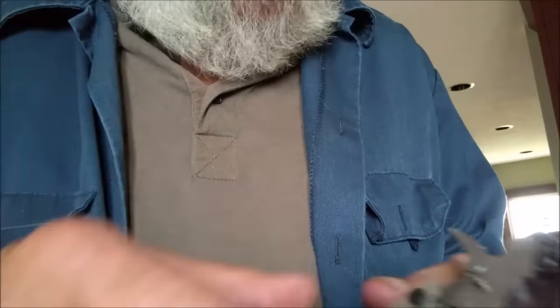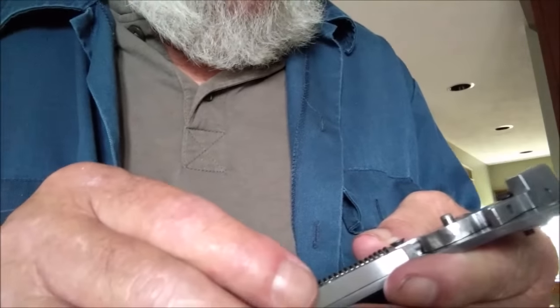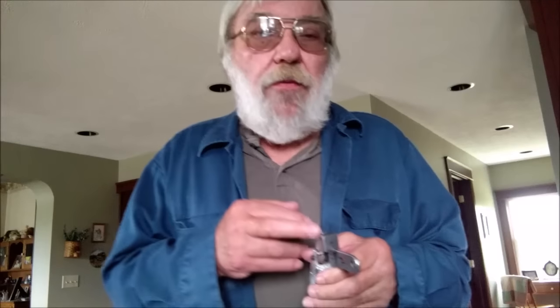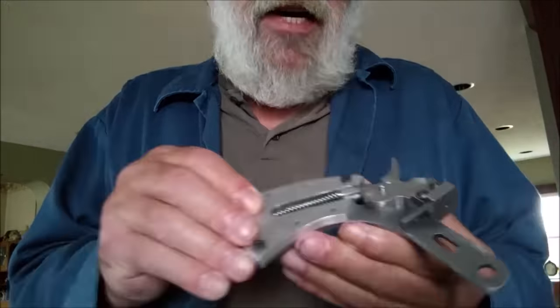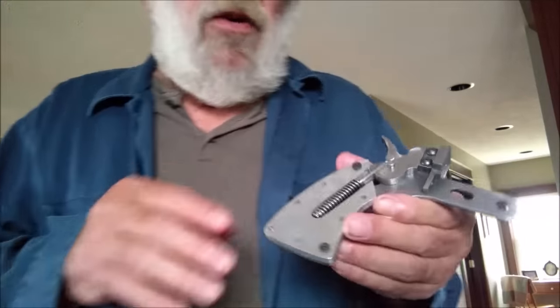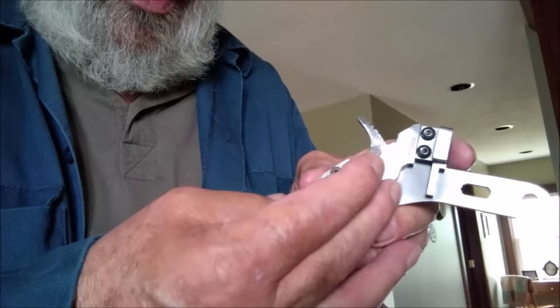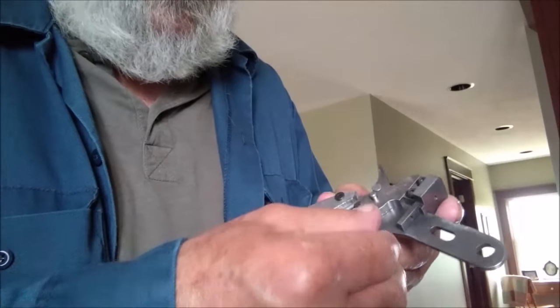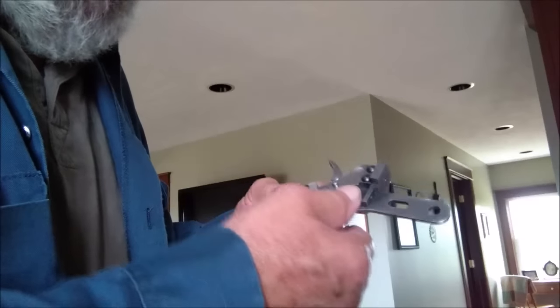I kind of threw it together last night. One thing I have discovered — like on my break-barrel shotgun, I silver-soldered the receiver together with the breech plug and you can't take it apart. When you bolt the breech plug in and can work on it with one half open at a time, it makes things so much easier because you can see what you've done. I'm sure when I get to making the trigger, sear, and sear notches, it'll be a whole lot easier to do.